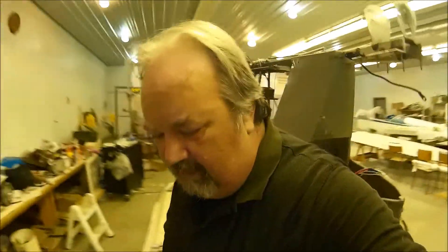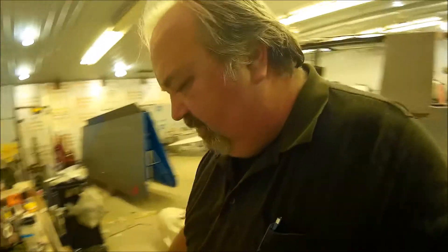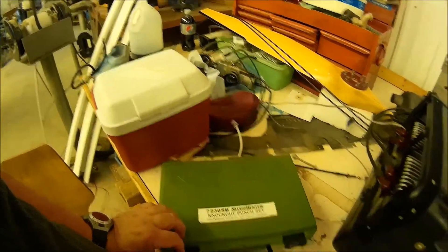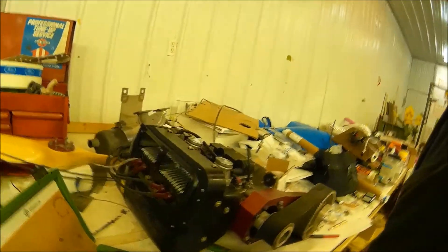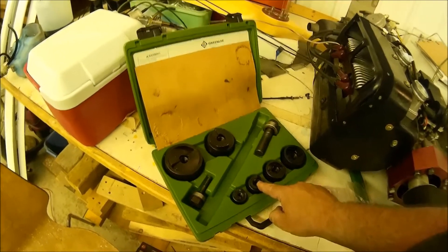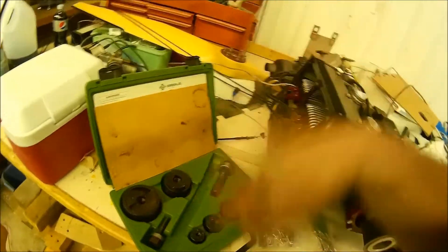So now I've got to stand up over here. Are y'all seasick yet? In order to get that hole in the right position — make it a little bit longer or oblong — I figure I'm just going to use my Greenlee punch set. This is what I use for punching holes in cabinets and electrical work, so it will suffice. I've got more than enough sizes to handle what I need. I'd probably use this die here and make the hole a little bit longer and oblong. I'll show you when it's done — it's going to be difficult doing it while holding the camera.